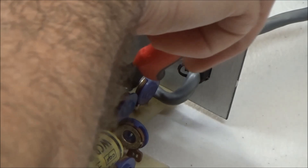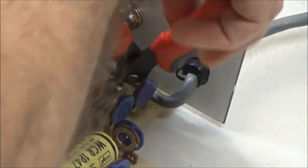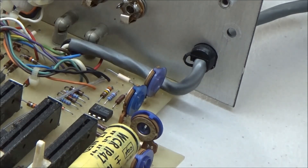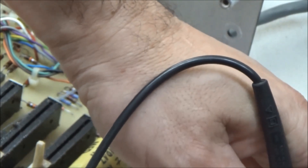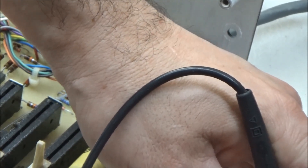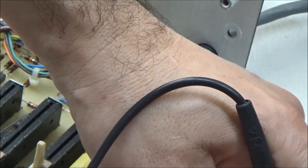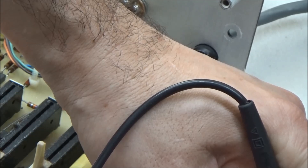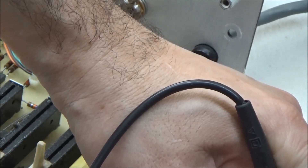Watch what we're going to do — we're just going to go in here and cut them off. I've taken those out, and now let's check to see if our short is still there. There is no continuity at all. The resistance is like 3.6K. So our short circuit is gone.